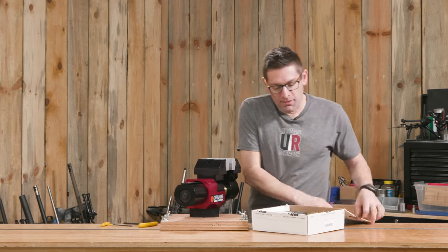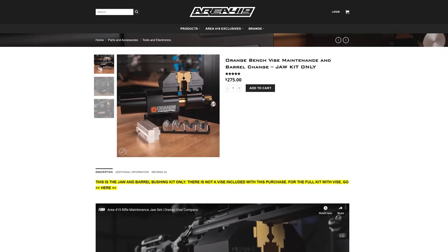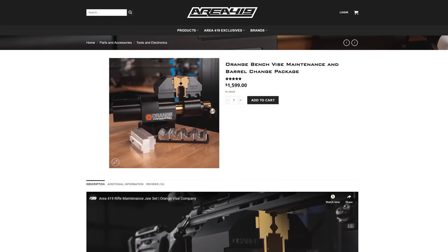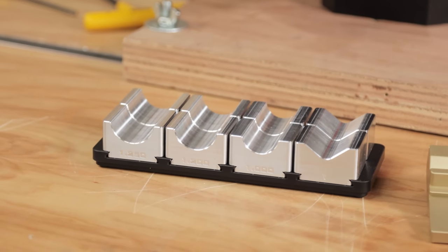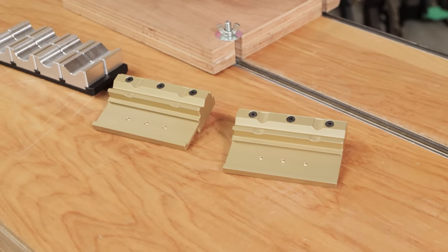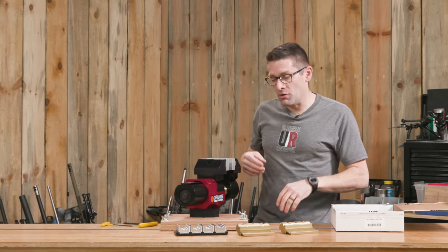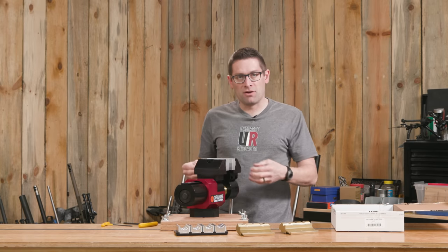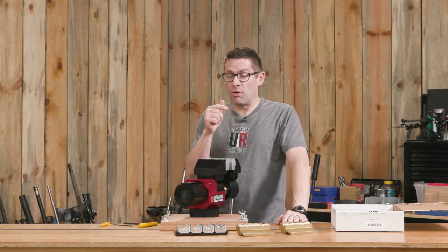Let's see what's included. This is a really nice set, and it's available in kit form as you see here or in combination with the orange vise itself. We've got the bushings for barrel change and each of the vise jaws, and these are going to be quick change — we loosen these screws, the original soft jaws pop out, and these pop in.